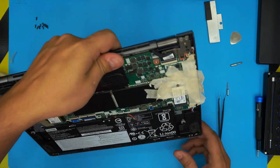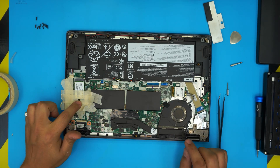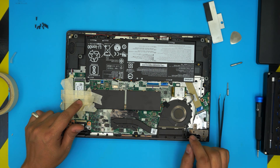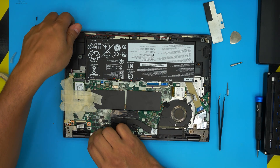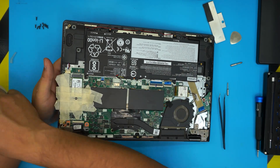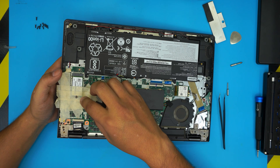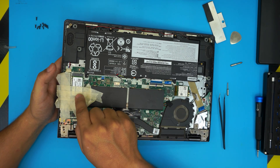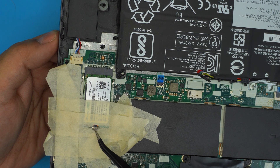I'm going to show you how I removed the stuck screw. The cutter I used to make the cut — I'll leave the link in the description. You can get a cheaper version or use your own imagination. What I did was use tape to cover all around the board so no metal particles would fly onto the components, then I cut right on top of the screw — a nice, deep insertion right in the middle.